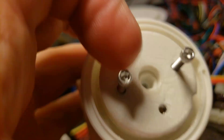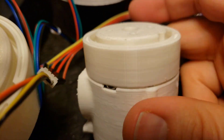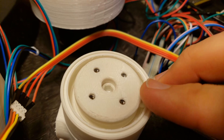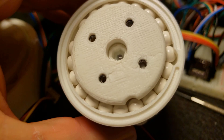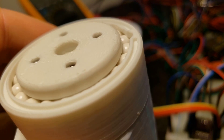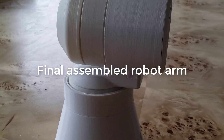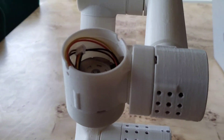I'm continuing to test the small actuator. Here's a shot showing how small the motor is underneath. Once I had it broken in with no friction causing the stepper motor to stall, I put the final set of BBs in and it's ready to go. In total you need to make three small actuators, one medium actuator, and two large actuators. Once you've got them all done and tested, you can assemble them into the final robot arm.